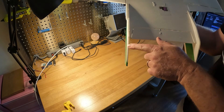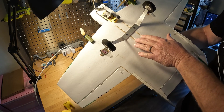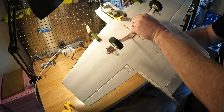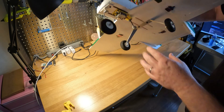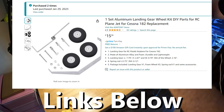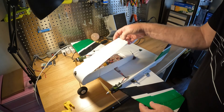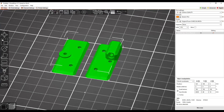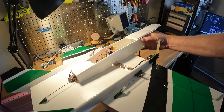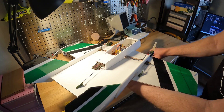This is a clipped zip tie that I bend and glue to the part that touches the ground. Where you mount the landing gear, use barbecue skewers or carbon fiber to spread the pressure of landing across the foam. I've hit the curb a few times so there are a few dings. I'll put a link below — you can get this landing gear on Amazon; it's for a Cessna 182. It's perfect for this plane and comes with the wheels, hardware, and nose wheel. The STL files also include a set mount that works with the landing gear. There's a small hole in the corner of the nose where you can put a Phillips screwdriver to adjust and make the front wheel straight.